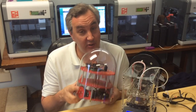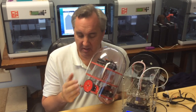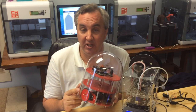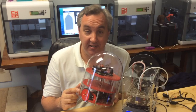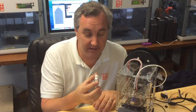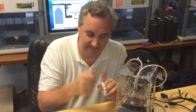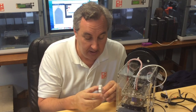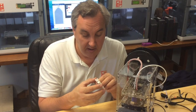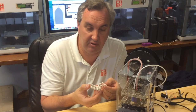I've built several robots over the years and this is one of my favorites. It's got these hard wheels with a rubber O-ring tire. I wanted something with more traction so it could go on rougher terrain. I found a tire and wheel combination on Thingiverse, so I decided to print the tire. About three-quarters of the way through the print I tried to pull it off the bed, but this stuff just sticks — I had to really gouge at it to get it off. It was all stringy and pitted. The bottom half printed pretty good but the top half was printing really bad, and I could easily peel it apart — it was not fusing together.